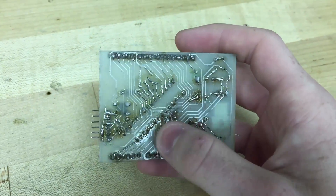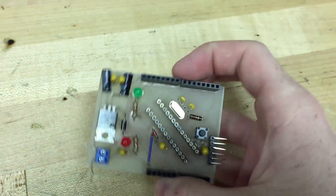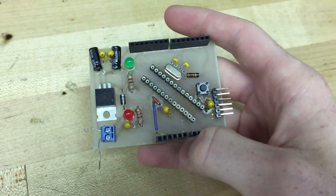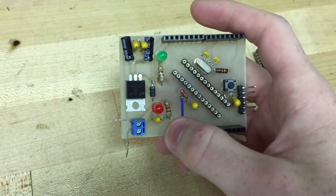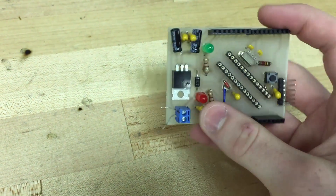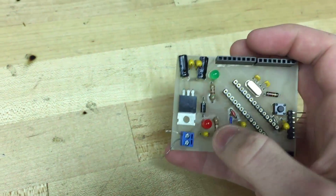But for the most part it was pretty good. The tin plating on the traces was really nice to solder to, so I'd definitely do that again. The 5V regulator really won't get hot in normal operation, and the ATmega 328 is not going to draw anywhere near 20 milliamps. With this design there are three jumpers, which is very good considering it's a single-sided board. This is a copy of an Arduino Diecimila or Duemilanove or something like that, and those are all double-sided with multiple layers. So considering it's a single-sided board, only three jumpers is pretty good.